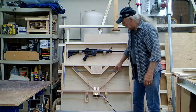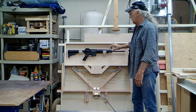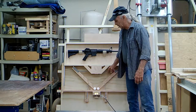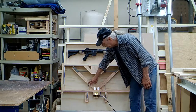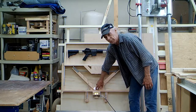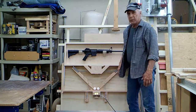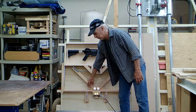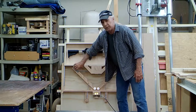If this were to get heavy, I can increase the strength of my helper spring, or if for some reason it tends to get light, I can decrease the spring. With these size gas shocks and the pivot points mounted onto the arms this close to the arm's pivot point, even though these are giving about 65 pounds of pressure, it's significantly reduced by the time it gets out to the lifting points.